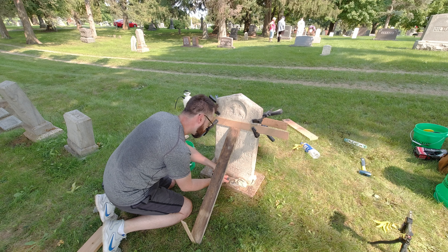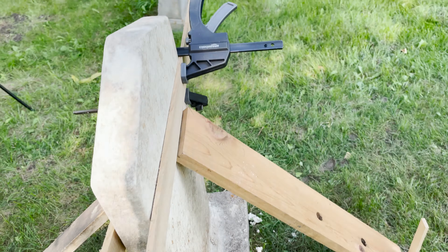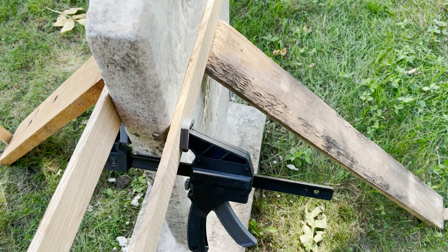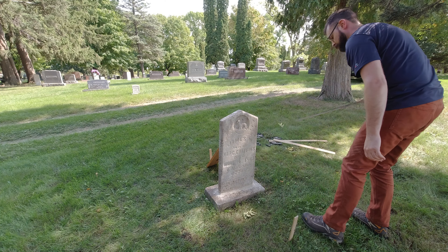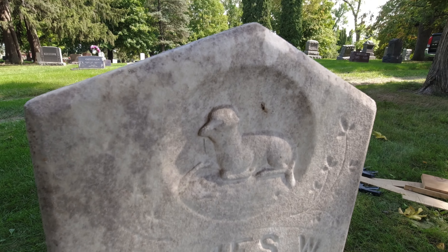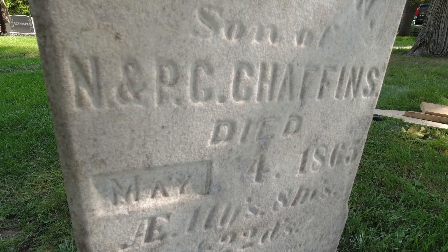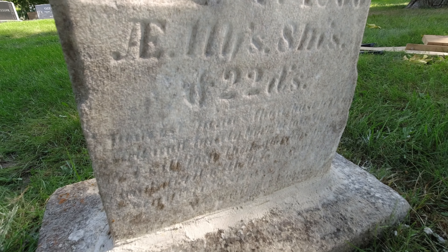You can certainly create a cement base, but puddling a marble stone into wet cement will just cause lots of problems. You can see here that I stood this stone up, got it plumb, and then you just let it sit overnight for it to set up. Then you're able to take these supporting pieces off and it'll set up nicely. The mortar is meant to be sacrificial — this isn't a forever repair, but it's meant to protect the stone in case of impact. If something impacts the stone, the mortar is meant to give way rather than having the stone break.